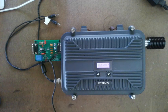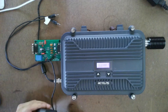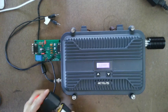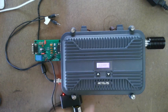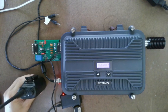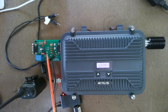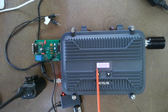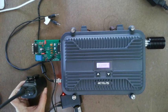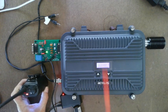We're going to check the hardware again. We're going to plug in the power supply into an extension cable. The power supply is plugged in — that's for the interface board. Obviously the repeater is turned on and we have a handheld here. When I key up this handheld, you're going to see a red light on the handheld, a green light on the interface board, and the repeater key up because the bar graph will go all the way up on high power.